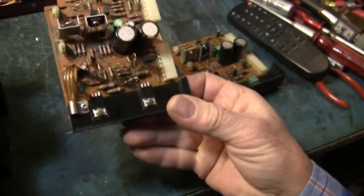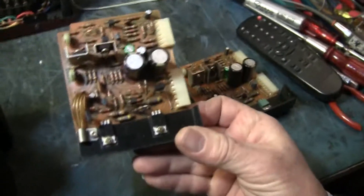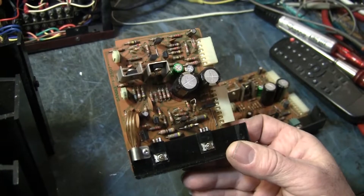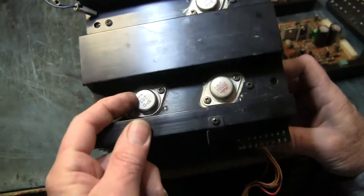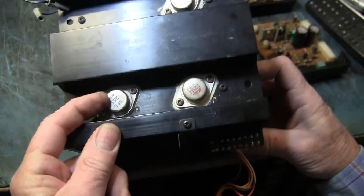But one of the channels has been repaired. One channel is distorted and I get into it and find two burned resistors on the driver board for the right channel. So I pull the boards out, don't find any bad transistors on it. I pull the power amp module out and realize they've used God knows what brand transistors in it. I thought, aha, they've got a bad rock in here.